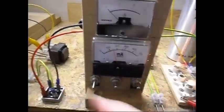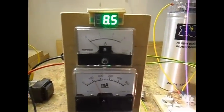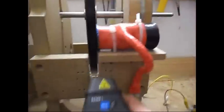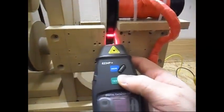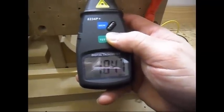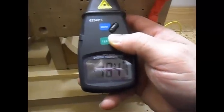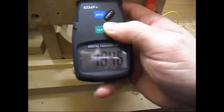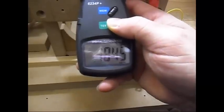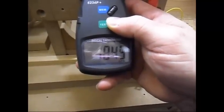I'm going to unscrew one of the light bulbs, because then you will see the maximum output of this coil — it's gonna be much brighter. The output is now 8.5 volt DC at 120 milliamps, which is pretty good. RPM is 1847, dropping a bit but still higher than the startup RPM. Pretty stable at 1845.